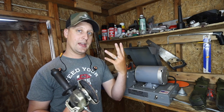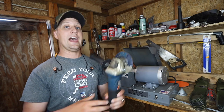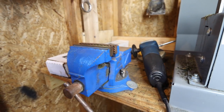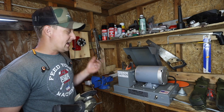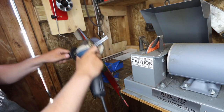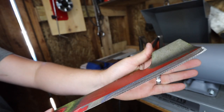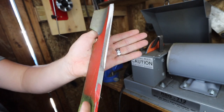Homeowners, if you guys are homeowners, don't tune me out either — who doesn't have a $50, $60, $70 angle grinder at their house? Here's what I use: I've got this little blue vice. I'll leave a link on Amazon — it was like 50 bucks. I just bolt this to my little workbench here. If you want to sharpen a blade with an angle grinder, put it in the vice, put it in at a diagonal, make five or six passes as you go up. Quite honestly, you'll be back in business in just four or five minutes.